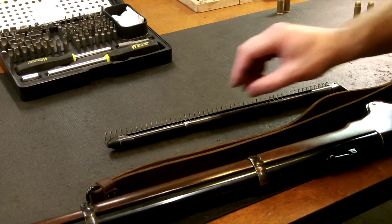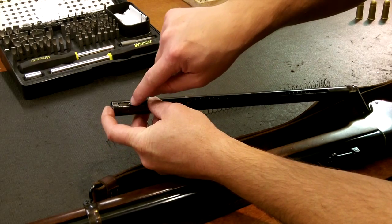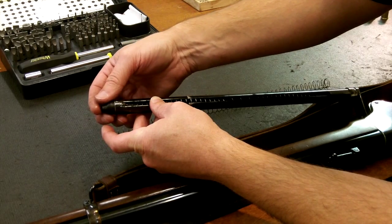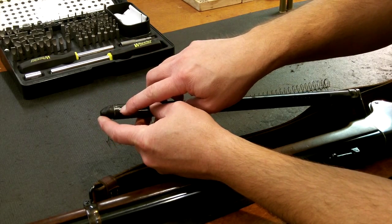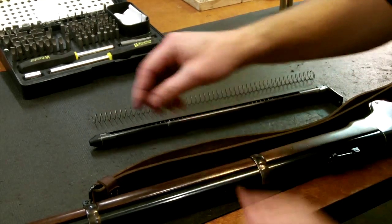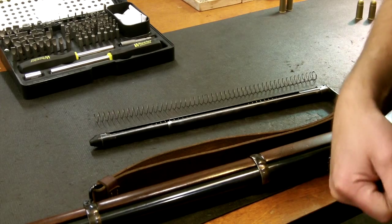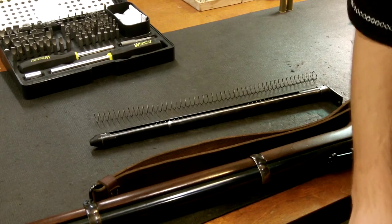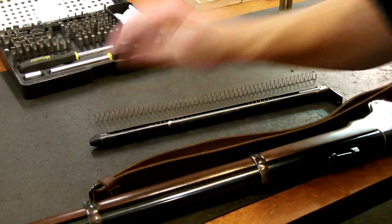One little caution: when you get ready to reassemble the magazine tube, the pusher has a screw that stops it from moving forward, and there are actually two positions on the pusher — one is further back than the other. One is designed for the .56-50 caliber and the other for the smaller calibers. If you get the two reversed and the pusher screw is not in the right location, it can actually bind up in the action when you run out of ammunition and cause you all sorts of headaches. So be sure to put the screw back in the hole it came out of.